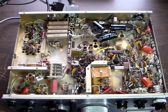They are drifty until they warm up sufficiently, and even after that they're not going to be quite as rock stable as your modern solid-state rigs. I believe we can make it a lot more stable than it used to be. A lot of the instability came from the components — they weren't quite as tight a tolerance as today's components.